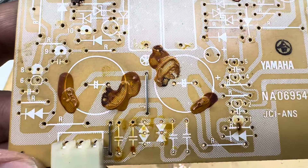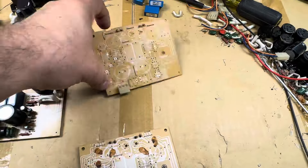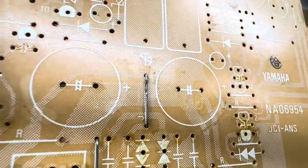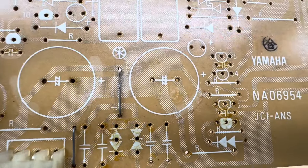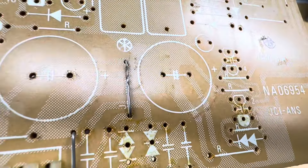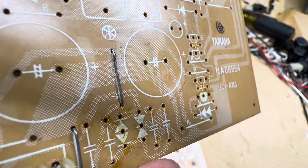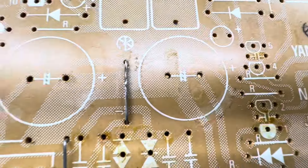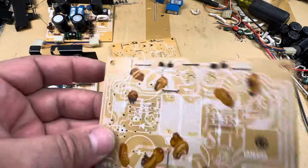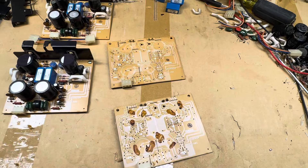The goal is, again, not to damage the silkscreen. You can see on this board that the glue touched that jumper and started working through the thin layer of copper, so I'm going to have to remove and replace it for good measure. That wasn't the case here, but still — the technique I've developed over the years is to just use a heat gun.